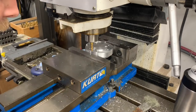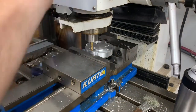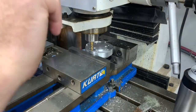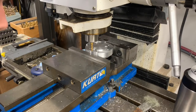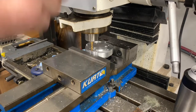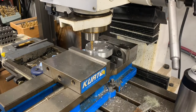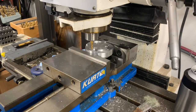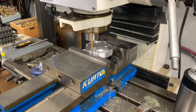It doesn't have to be exact, it just has to be close, really, because the quarter inch bolt that I'm going to use to make my plug is much larger than the M2.5 millimeter, but we should try to be as close as possible. So anyway, before I go in with the drill, I'm going to go in with a 3/16 two flute end mill, which hopefully will be a little more forgiving if there is still a little teeny bit of tap left down in that hole.